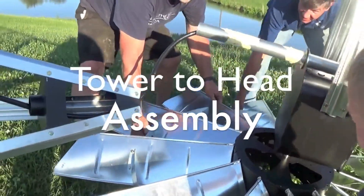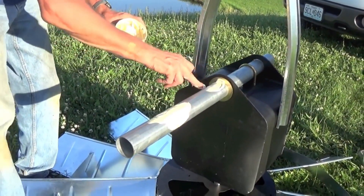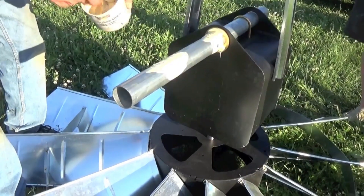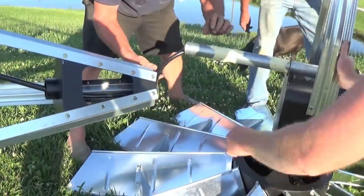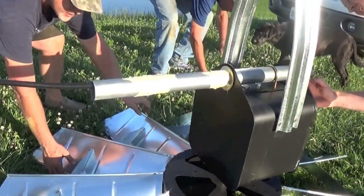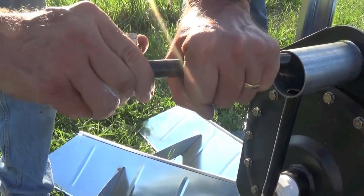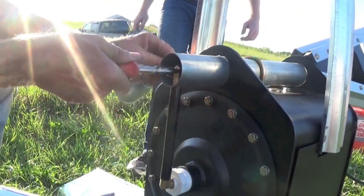Attaching the head to the tower. Lay the tower on a sawhorse or other 3 foot lift. Grease the inside of the cone using industrial grease or white lithium grease before inserting the windmill head into the tower. Next, insert the tube into the black tower cone. Insert one end of the 1/2 inch poly tubing through the bottom of the pivot tube. Lubricate the 90 degree hose barb elbow and insert one end of the hose. Push the other end of the hose barb through the hole in the pivot tube into the hose coming from the compressor top plate.